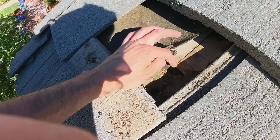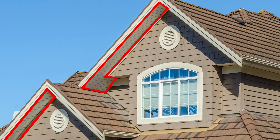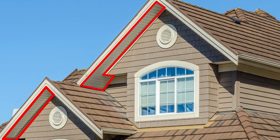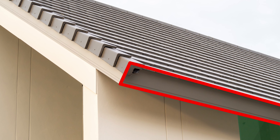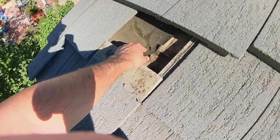This is a point of water entry for sure. Luckily, it's on the shiplap on the eave. You can see the water stain on the paper itself, so you know water is collecting in that area. The wood has all its seams right there, and so it's likely starting to seep through, starting the process of wood rot. Shiplap is basically a one-by board you see typically on the edges of a roof where you see the overhang — the eave is where your gutter is mounted. The fact that I can see the shiplap underneath tells me this leak is occurring at the overhang on the roof, not in the interior attic space — not in the home itself. There's a big overhang on this house so it won't be coming inside, but this is definitely an area of concern.